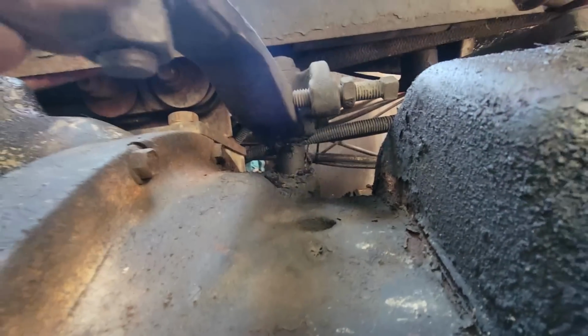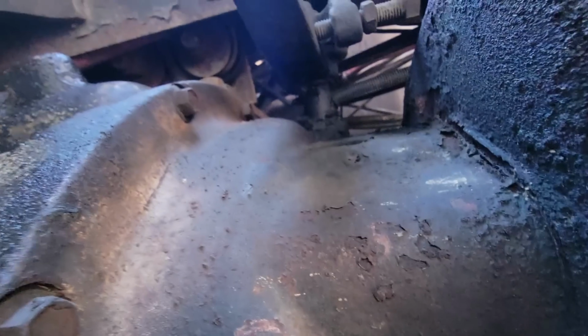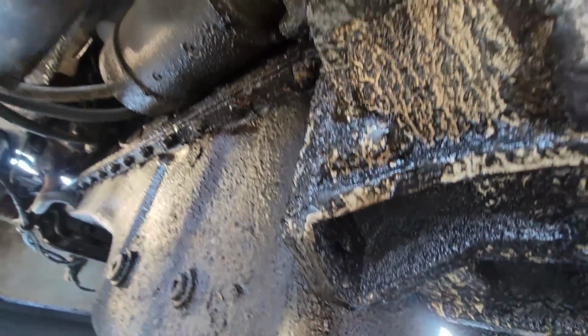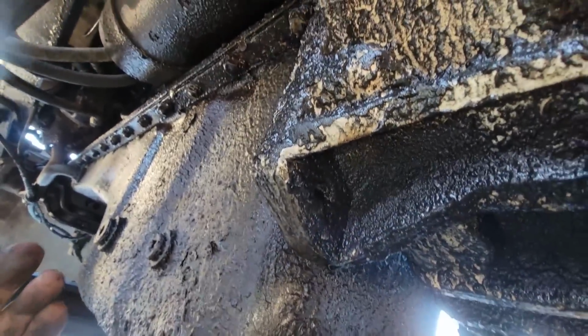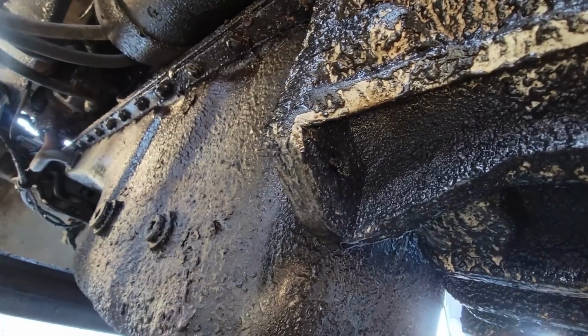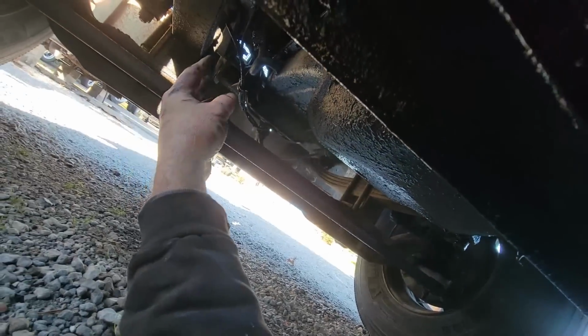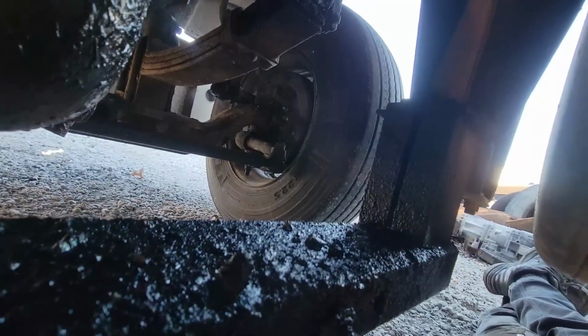And then if we're taking it apart, I think we're going to go ahead and put a cross shaft and bushings in. And then we'll see if I can talk him into doing that input shaft, because the bearing was a little sloppy. Anyways, you can see how badly this thing leaks oil. And this thing tops out at 52 miles an hour, tops pegged. So, all right, next thing we got to do is get the front end jacked up. We got to check kingpins, start checking some steering components. Let's see what's going on there.